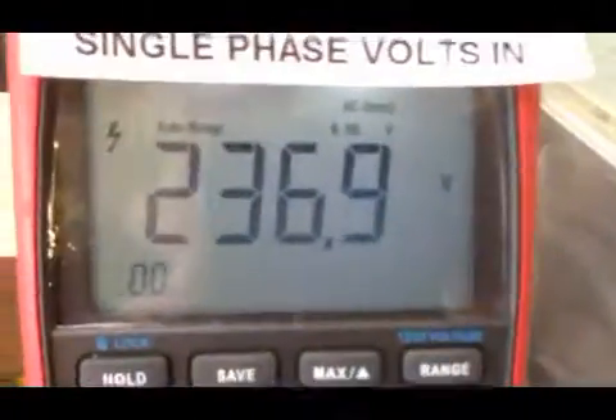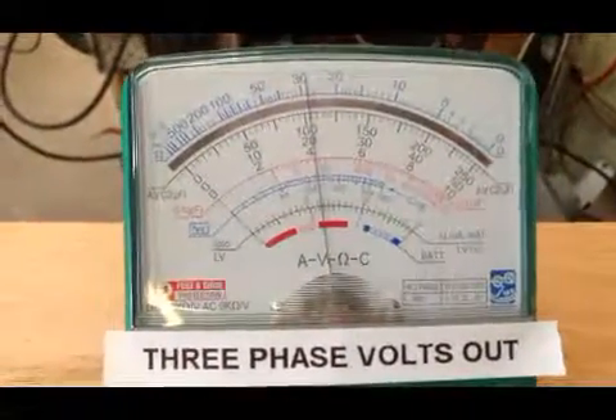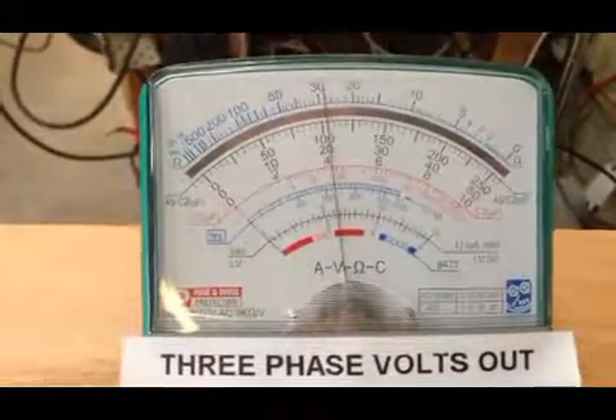I'll put a few meters on here — one is our input voltage, which I've made adjustable through a rather decent-sized variac. Over here I've got our three-phase output voltage, which we're currently looking at 400 volts. I've used analog meters because they're nice and easy to read. Our current idle current is 1.5 amps. This is a 6-kilowatt converter, so we have a 6-kilowatt pilot motor sitting on the floor next to us.